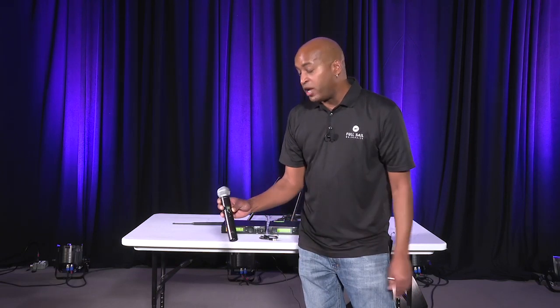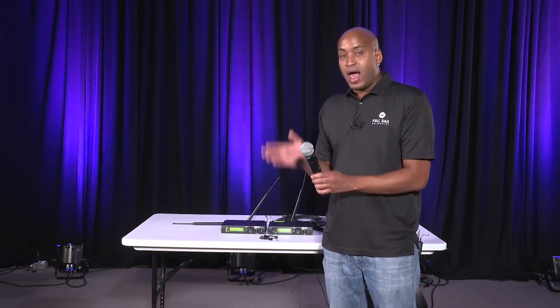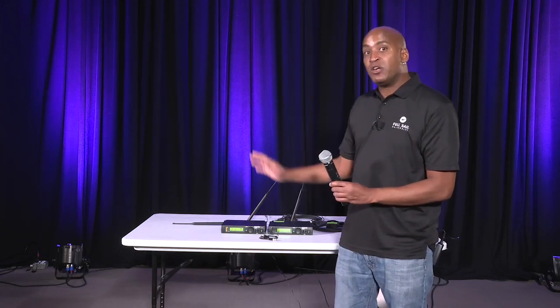So just to explain real quick the whole group and channel thing, what the manufacturer has done is they have found frequencies that play well together, and they have grouped them together and denoted them as different groups. So a lot of times if you have a lot of wireless and you find a clean group, what you would want to do is try to have all your wireless in that same group because you know that the channels within that group are going to play well together.